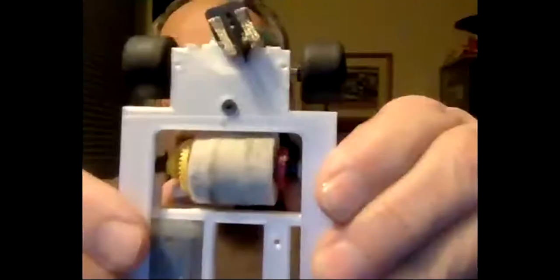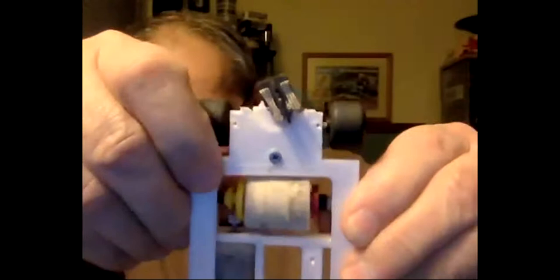The pads are not very round, so they do tend to touch in some places and not in others. So the pads are marked. I don't know if you can see. The pads are not consistently marked all the way around. You need a pad truer. Yes, exactly. I need to print out a reciprocating pad truer, a tire truer.